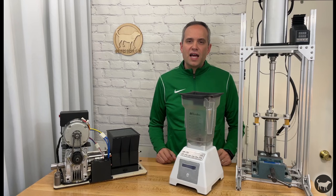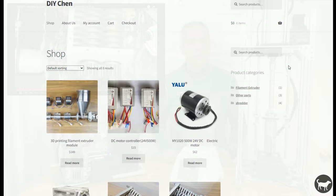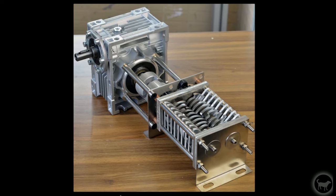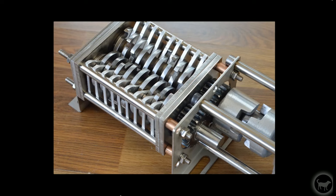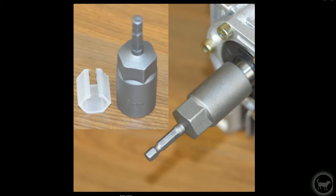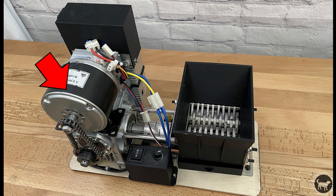I found a bunch of YouTube videos by a user named DIY Chen that goes over how to make your own heavy duty shredder. He has created a bunch of them and also has a website where he sells some of the machines already put together. I purchased one of these from him and it arrived in a reasonable amount of time with everything you would need to get started. It was designed with a worm gear reducer that allows you to increase the torque on the machine without exerting tons of force. I wanted to spruce it up a little bit so I designed a 3D printed hopper to keep all the plastic in the jaws. I then added an electric scooter motor that I had lying around for years.